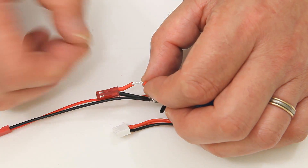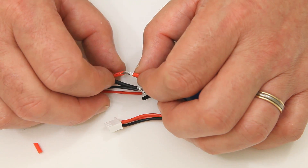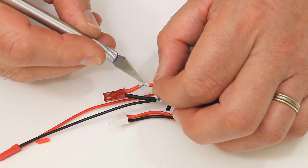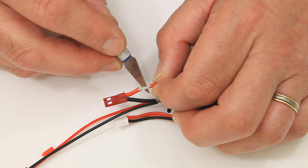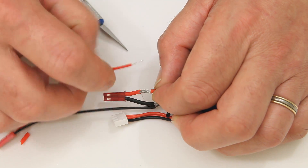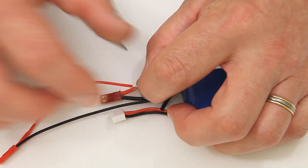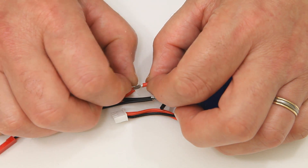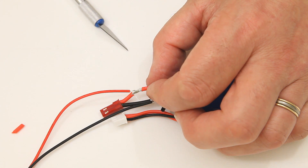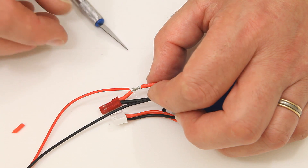That's wound up coming off — my theory of rolling that back over isn't going to work. I think I need shrink wrap or some insulation tape. I also made sure that the wire I'm using on the JST connector is of equal thickness to the wire on the gimbal itself, so make sure of that — don't use thin wire if you should be using thick wire.